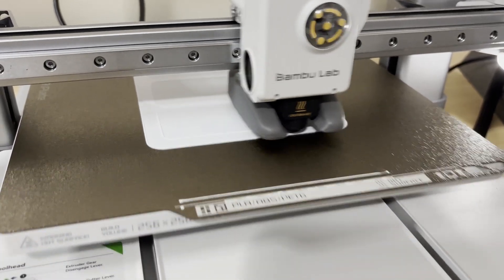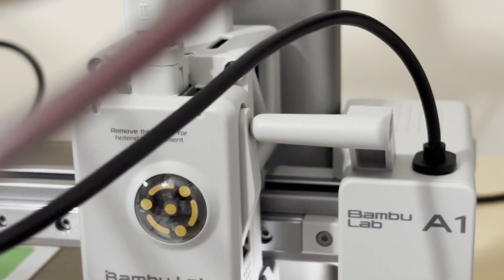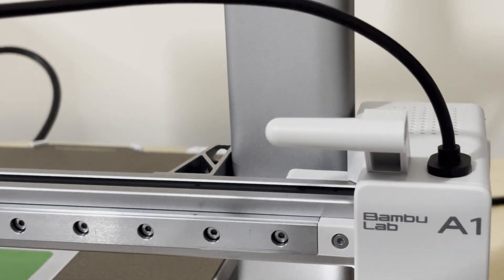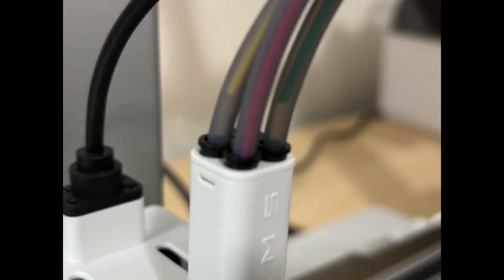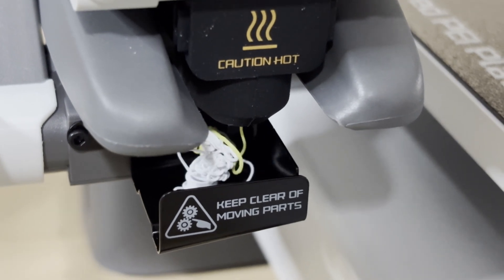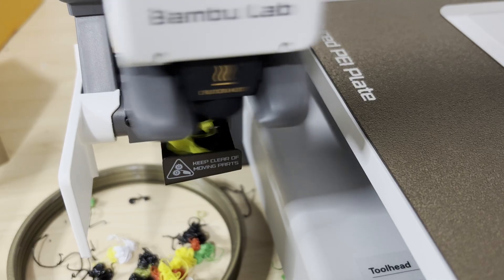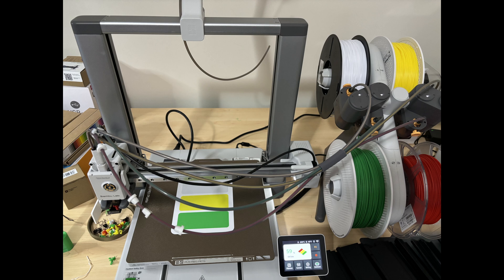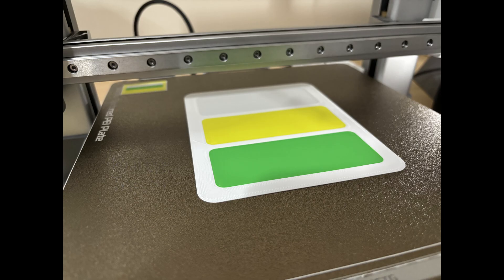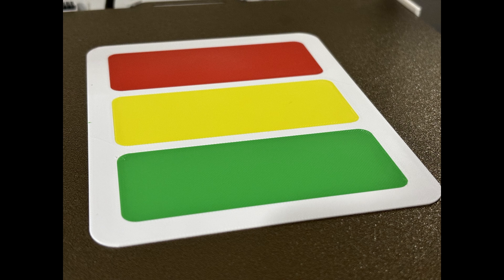You can see here the A1 printer can print fast even for a bedslinger. Now we have a second layer with some space for colour. The extruder slides along to the end and pushes against the arm and a blade in the extruder cuts the filament. The printer has a multi-colour AMS unit that can hold four colours, each fed into the extruder via a four-to-one hole arrangement. Now the printer extrudes the white filament and replaces it with the next colour — wow, that was fast! We can see the filament being shot out of the poop chute. The printer prints out a purge tower to prime the nozzle before moving over to the print to give a clearer print overall, then repeats this for each colour change. I designed a gap between the colours to give better contrast. A third print layer gives deeper colours and a final thickness of 0.6mm, so it's still quite a thin part. Doesn't that look great?